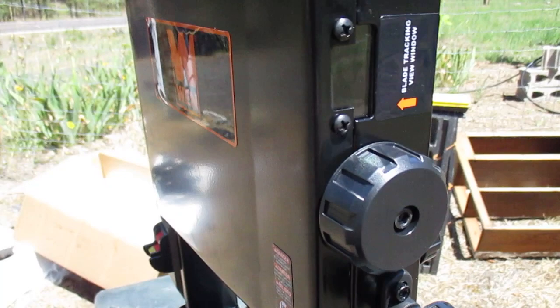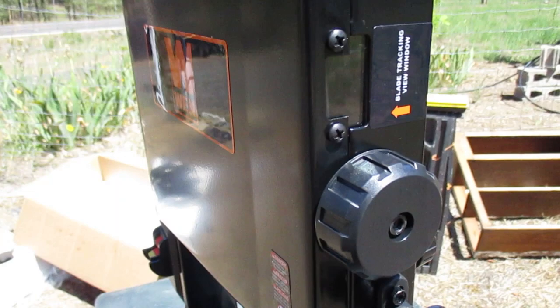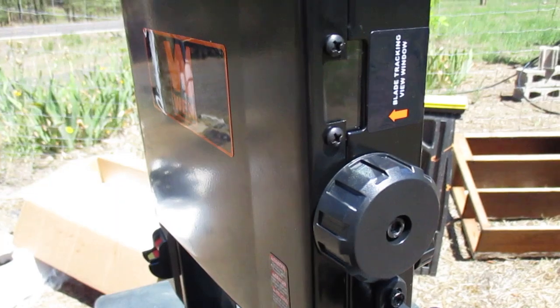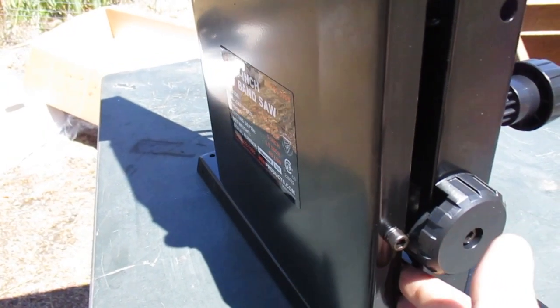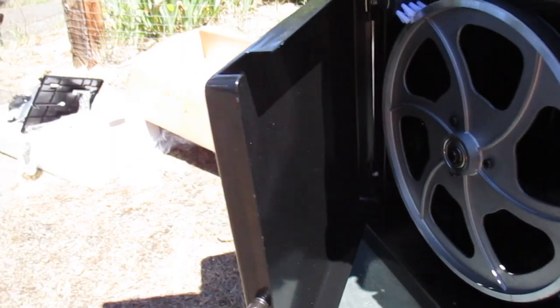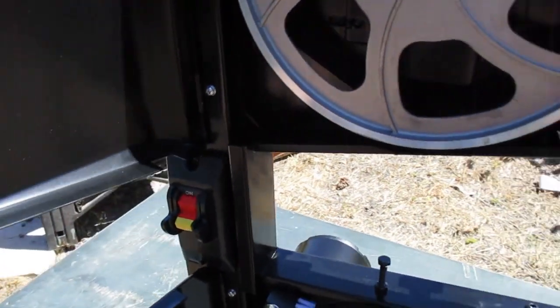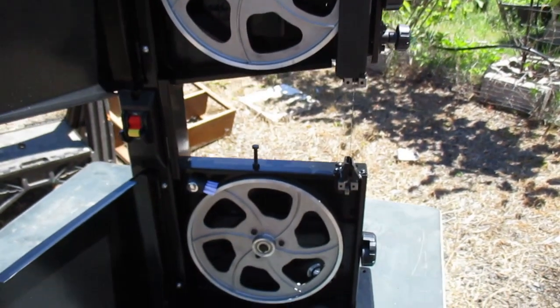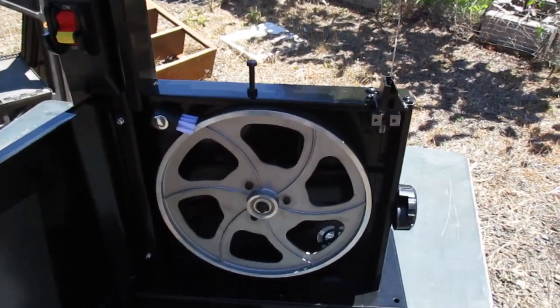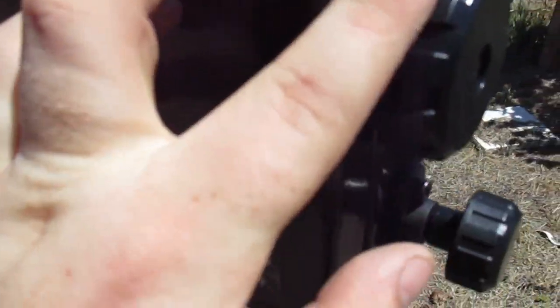When taking a closer look at the saw, there are some nice details to make note of. There is a small window directly above the door release so that you can see at all times if your blade is remaining on track without having to actually open the door — I've never seen this before and thought it was a really cool feature. Rather than the traditional single door for both wheel compartments, there are two separate doors that can open and close independently. Both doors are steel instead of plastic and both wheels are aluminum. I'd prefer steel wheels but aluminum makes the whole machine lighter. On the lower wheel there is a small brush on the left side that will clean the blade as it comes through — it would have been more useful on the right side, but it's better than nothing.